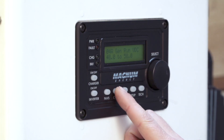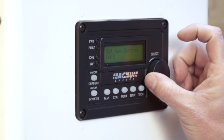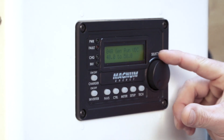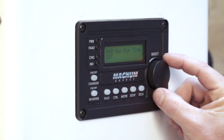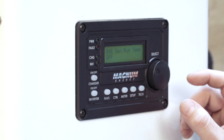To use those settings, we circle back to control, go to gen control, and set it to auto. I want to point out all the other parameters in this menu. Gen run VDC is the first thing — that's what we're using. Pretend gen run time isn't here; it says off and we want to leave it off. Gen run amps is off, gen run SoC is off, gen run temp is off. We're just going to focus on volts DC as the parameters that start and stop the generator. The reason is that the Magnum battery monitor kit gives you a state of charge reading but it's not always 100% correct. Voltage is the most solid piece of data we have to work with.